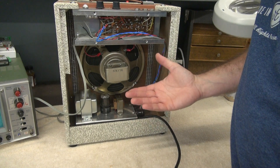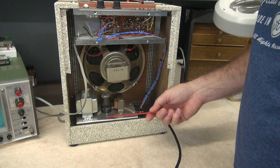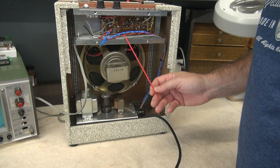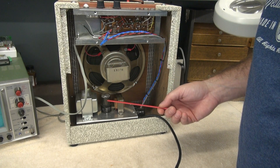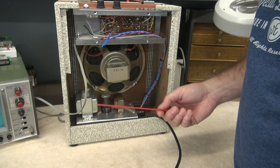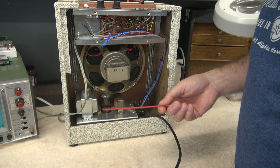So what a great idea. Now, here's the part you've got to keep in mind. I used a 6X5 rectifier tube. The current rectifier on this chassis is a 35W4 — well, it's gone. You have to remove the 35W4. Also, you have two 12-volt tubes and a 50-volt tube. So the 12AV6s will be swapped out with 6AV6s, and the pinout is identical, so that's a no-brainer.